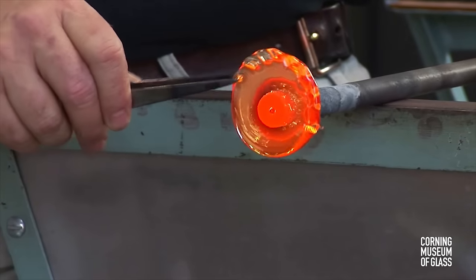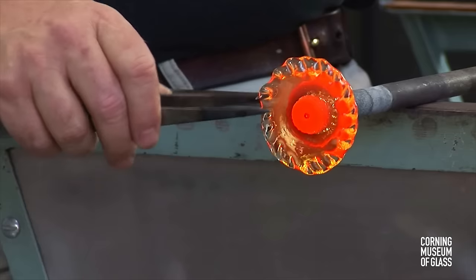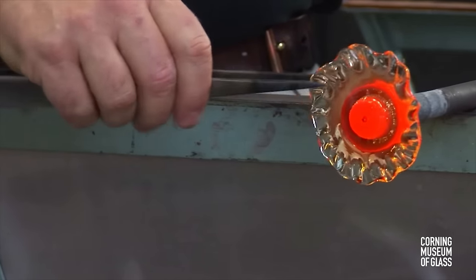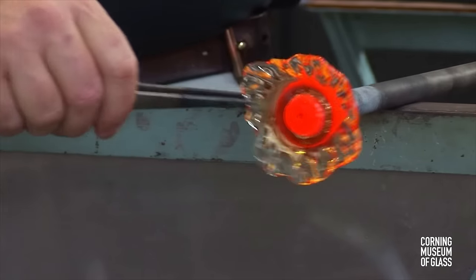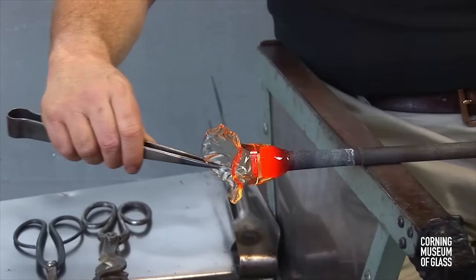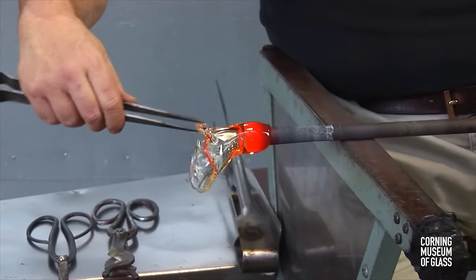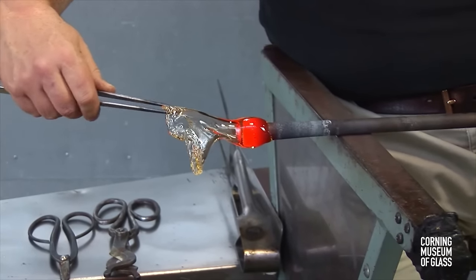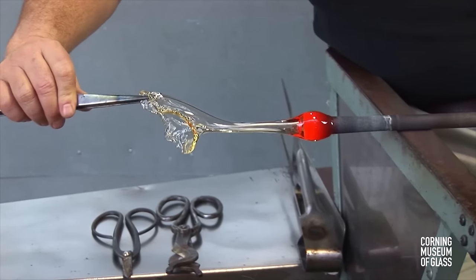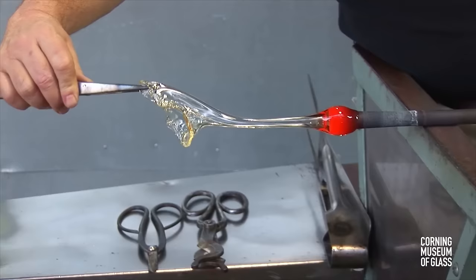There are a number of ways of making glass tubing without glassblowing. This is one. A gather of glass has been made on the end of a metal rod. The edge is being pincered, and at a certain point the pincered edge is pulled outward, and this begins to draw glass tubing from the reservoir at the end of the metal rod.